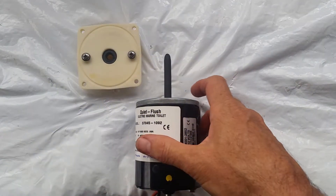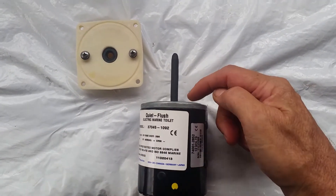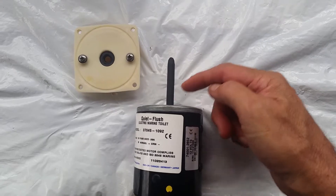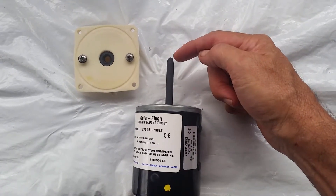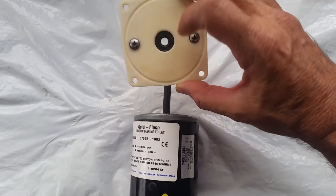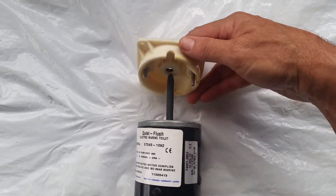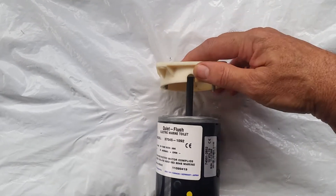You can see I've put the sleeve on, used the heat gun, and shrunk it onto the shaft. I've also shrunk just the very tip of it to form a nice little lead-in, which helps guide the seal over and fold it up.